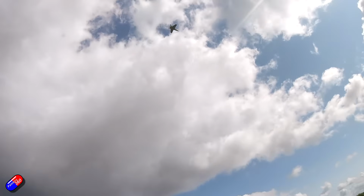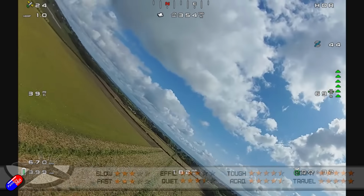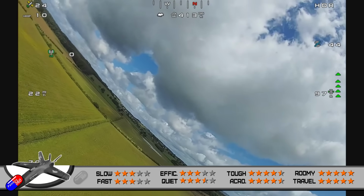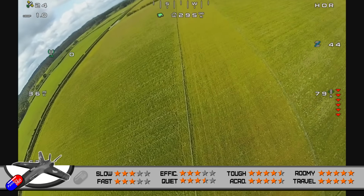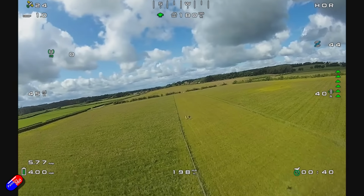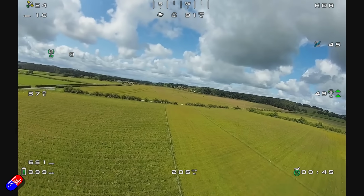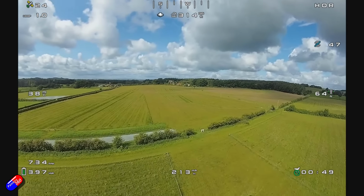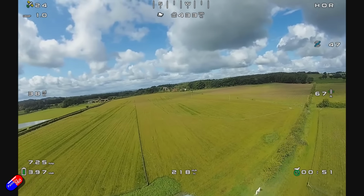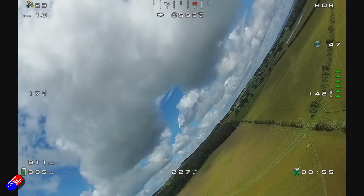In terms of high speed, well, now we're on 6S, and that prop though isn't particularly aggressive. It's only 8x4, which isn't going to be ridiculous amounts of pitch speed. It isn't a speed machine in this default configuration. Testing here has found that it can fly at just about 80 miles an hour, and that's going to pull about 31 amps, about 677 watts at that full throttle. So I wouldn't call this a speed machine right now.